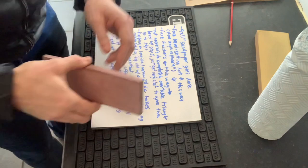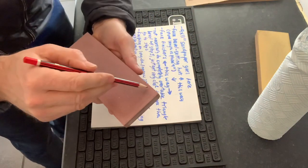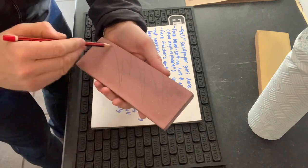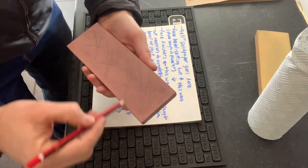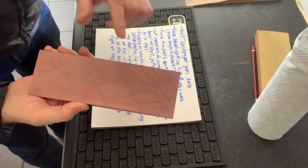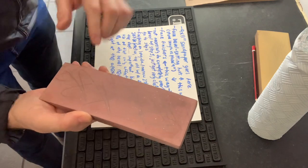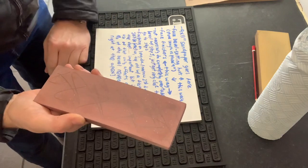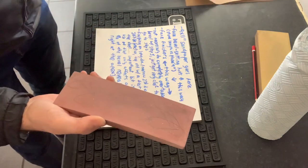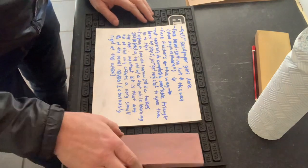To get that shape — which was originally flat — you put it on your sandpaper and pencil the edge, just like you would when lapping a normal flat hone. I'm going to lap this again because it's got a bit grimy and swarfed up from the last video. I'm going to use 60 grit — this is what I did — and to achieve the shape it took me about an hour and a half on 60 grit.